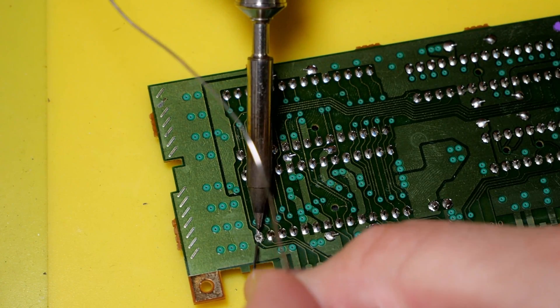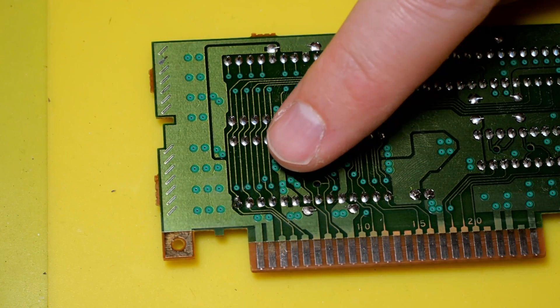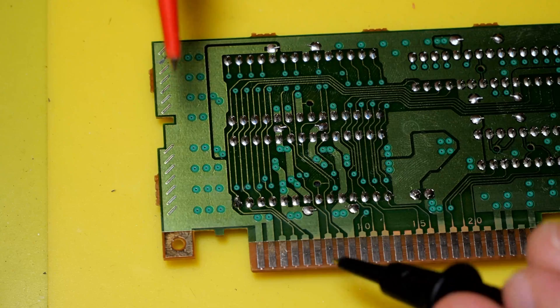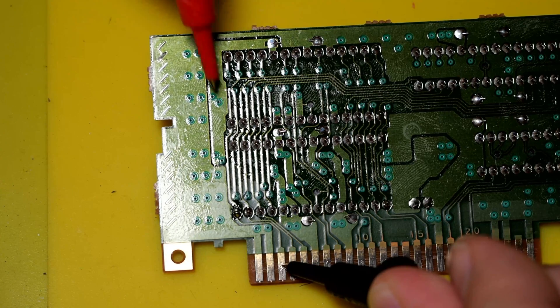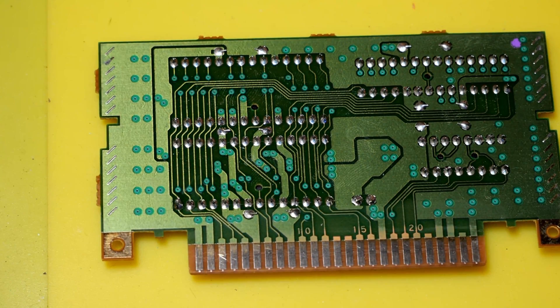So usually with something small like this I just take the tweezers and get the protective coating off a little bit, so now we have a little bit of the copper exposed there. We're going to put some of our rosin-core solder over this and just extend it a little bit to bridge that spot. We'll take the solder and plop it into place — we made our blob just a little bigger there so it bridges that connection. Testing it out now — it's making it through to there and it makes it all the way to the end now.